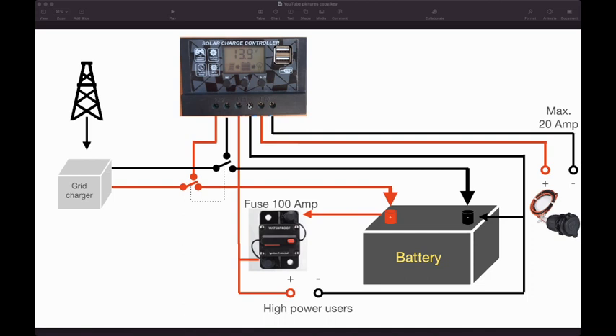The two central connections are connected to the battery and you must do this first because it needs power to wake up and operate. The two right connections of the solar charger are connected to all users, together taking not more than 20 ampere or 240 watts. This output is also controlled — if the battery discharges too much it will disconnect and avoid damage to the battery. It is also possible to take much more than 20 ampere from the battery directly because the battery is able to deliver that.